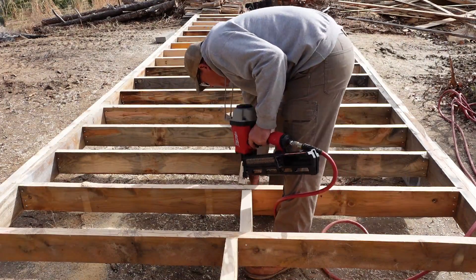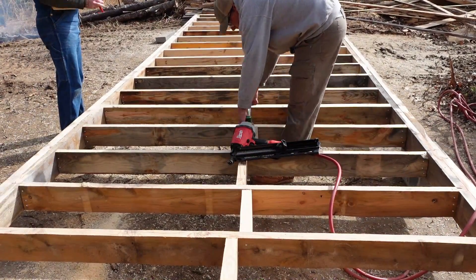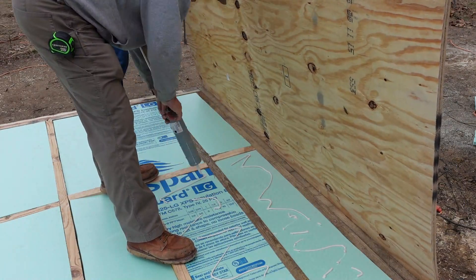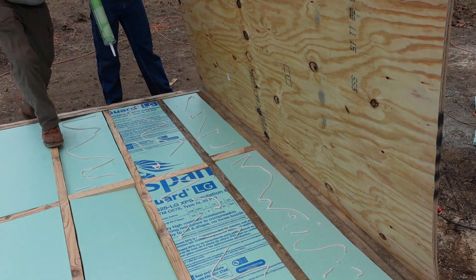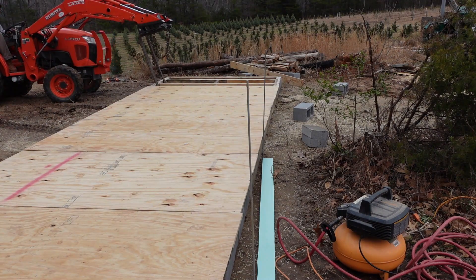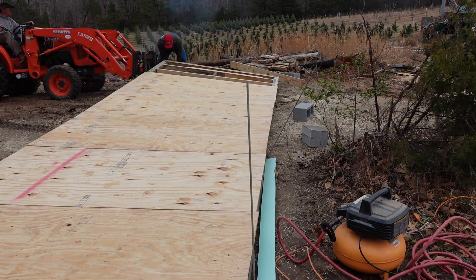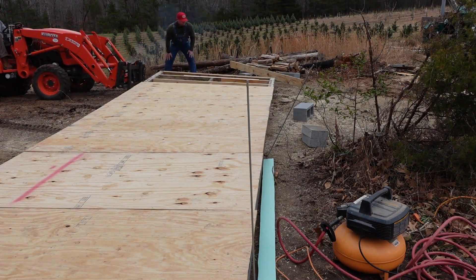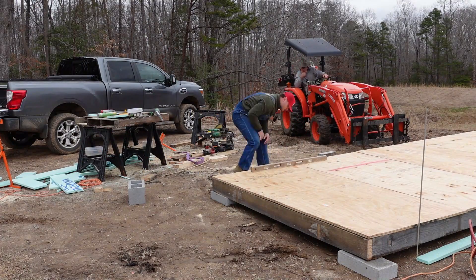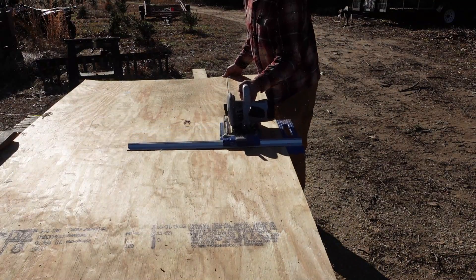This project started off with framing the base — an eight-foot wide by 24-foot long platform. Once we blocked up all the joists we cut some foam insulation and fit it into the platform, put down some construction adhesive and the subfloor on top. We then lifted the whole platform with the tractor and pushed the foam insulation up tight against the subfloor so the construction adhesive would hold really well. Then we moved the platform so it aligned with the south for maximum sunlight, lifted it with the tractor, put blocks under it, and made sure it was perfectly level.